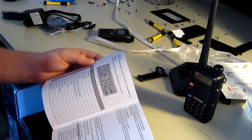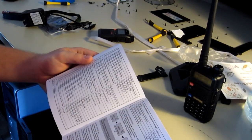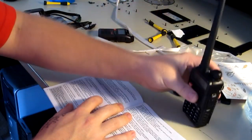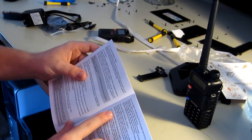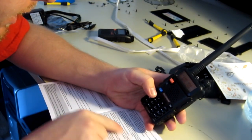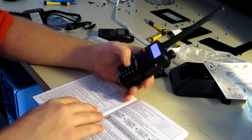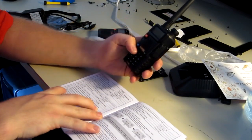If you see repeater split and then hit make the repeater split on, it has dual watch, dual reception with the two frequency. It has a double frequency, so there must be a dual watch display or dual watch ability. SFTD is what we want. That is direction of frequency shift. Menu. What number is it? SFTD? It's number 25.